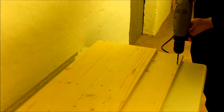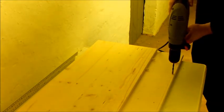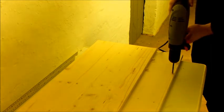And then we'll go back to your 6mm drill bit. Again, do the same again, nice and easy. Not too much. You've got to be very careful not to drill past the bottom. You can easily do so. After that, give it a quick shake or blow. Obviously you've got to be careful when you're drilling, and you need to wear safety goggles or something like that.